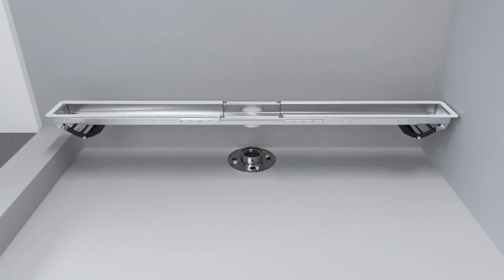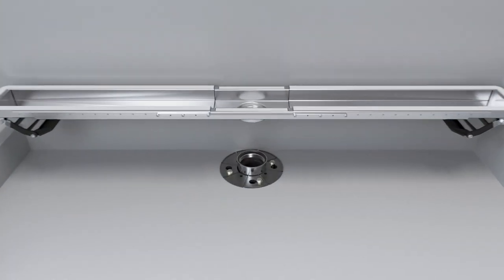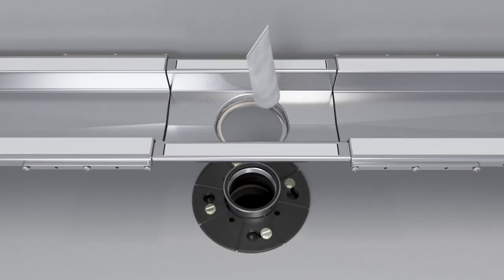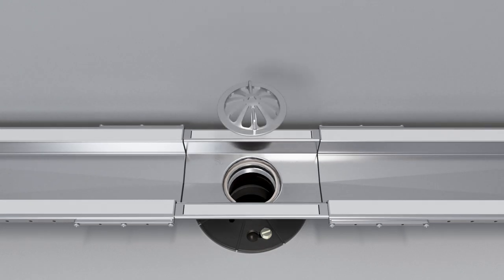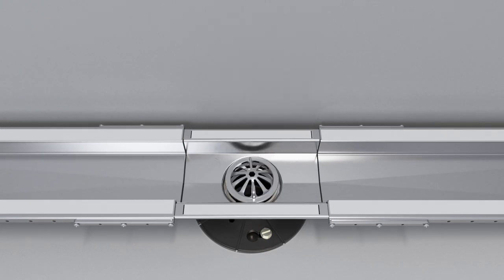Reposition the drain into the shower enclosure. Apply sealant to the inner edge of the drain hole. Place the drain onto the threaded tailpiece. Insert the threaded collar. Secure the assembly by attaching the strainer to the threaded collar. If needed, tighten the strainer using a quarter-inch hex wrench.